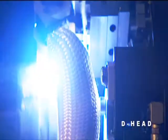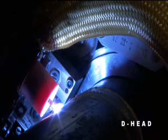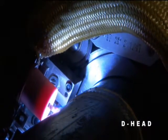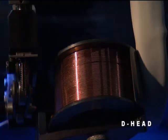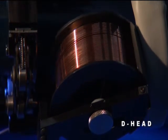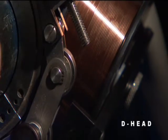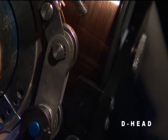The D-Head has full function capability. With its 200 amp water cooled torch, it has the capability to continuously reproduce all of the motions of a skilled welder. Its filler wire system uses a standard two pound or one kilogram spool with a range of wire diameters. An optional low profile kit reduces radial clearance to just two inches or 51 millimeters.